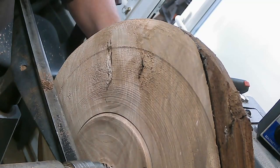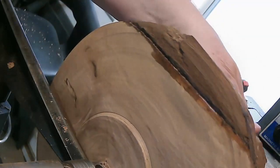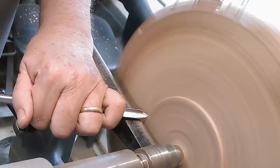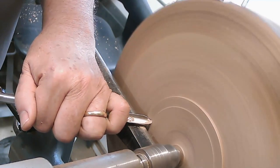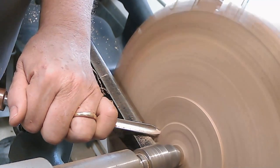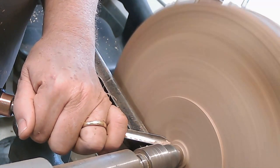At this point I'm beginning to get a little bit concerned that the bark is standing a bit hollow, so I stopped and poured some more superglue in, which I hoped would be good enough, but let's just wait and see. I did a bit of refining of the profile of the dovetail with a skew — it's a dovetail, not a C gripper. Then it seemed like a good idea to dress the bottom of the tenon as much as I possibly could, because if possible I'd try and avoid re-chucking it. If I can get a decent finish now with a good diameter for the tenon matching the jaws accurately, there's a reasonable chance I don't have to re-chuck it, or at least only re-chuck it for a small amount of work.